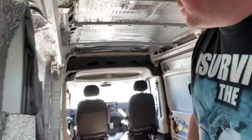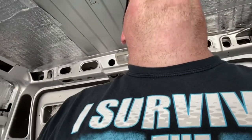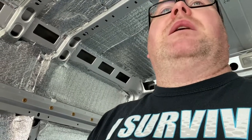In this case I'll have to put wall paneling behind the cabinets and get them tacked in somehow, because there will be a gap between the cabinets and the walls — these Pro Master walls are kind of at an angle. Before I start painting this afternoon I want to do a little wiring and figure out how I'm going to handle the lighting and where the switches are going to be.